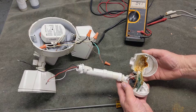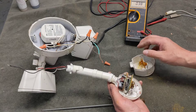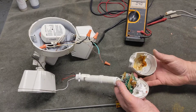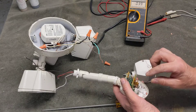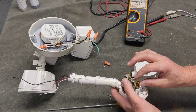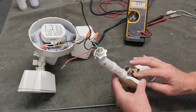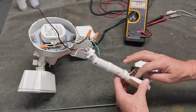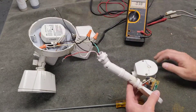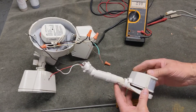Sure enough, when I open it up, I see rust and corrosion inside. The circuit boards have damaged components. It appears water came in from the bottom where the dial is that controls the potentiometer — it looks like water weeped up inside and damaged all the parts. You can also see a big relay, with the red wire coming off of it. The relay actually switches power onto the red line which feeds into the power supply. That's the problem — water intruded and damaged the motion-sensing switch.